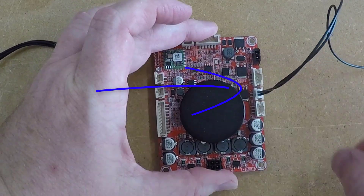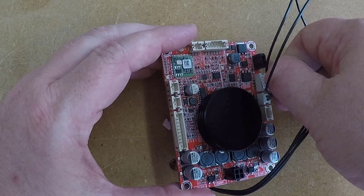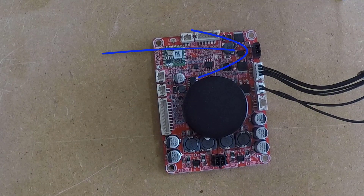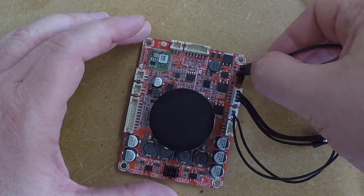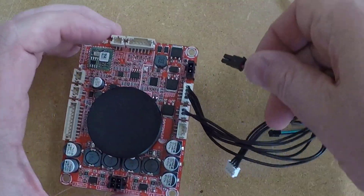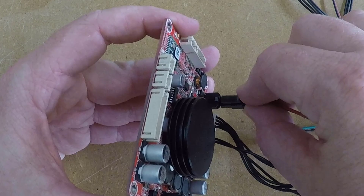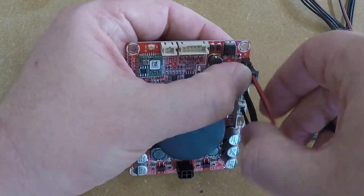Next is the on/off power cable — this is the wire from the toggle switch, a pair of black wires. The third connector has four pins; this is the battery connection that connects to the lithium ion charging board. The last connector on the right hand side is a two-pin black connector — this is the DC power cable. So we find the power plug on the harness and plug that wire in. It'll be red and black. The clip on the cable slides over a tab on the inside edge of the connector.